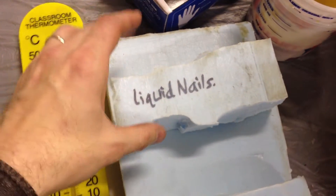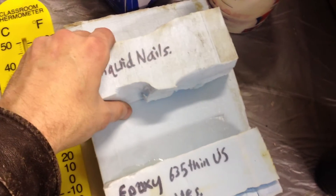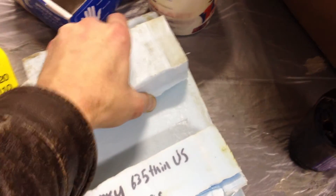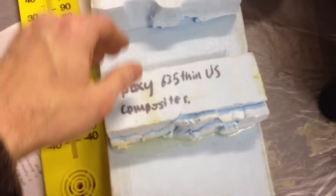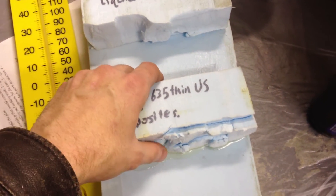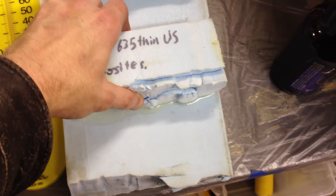The top — this is foam on foam put together with liquid nails, and I'm just trying to pull them apart. It's fairly rigid. Here's epoxy from U.S. Composites, type 635 thin epoxy. I'm trying to pull that apart. Looking on the side, it doesn't look like the adhesive has eaten into the foam, which happens with some types of adhesives. That's one of the things we were checking. You can see the thick beads of liquid nails — we didn't have enough weight on it, it looks like. So that's a lesson learned.